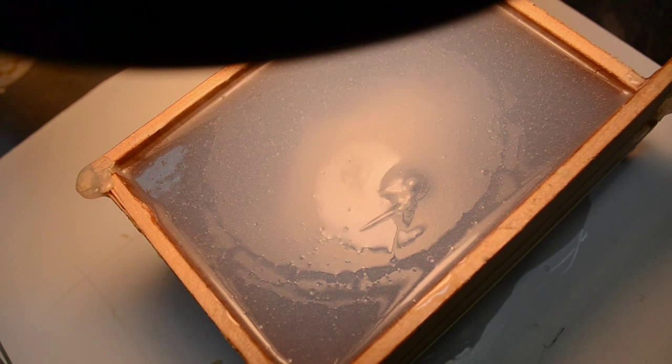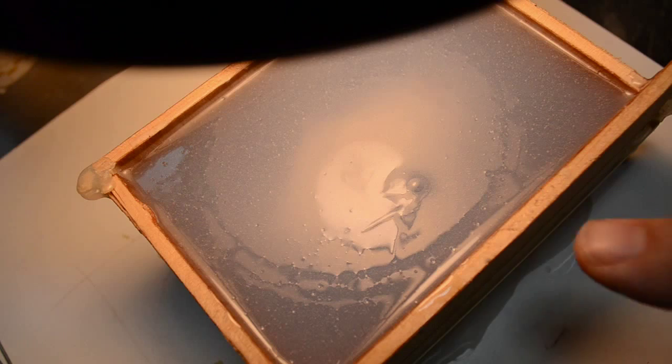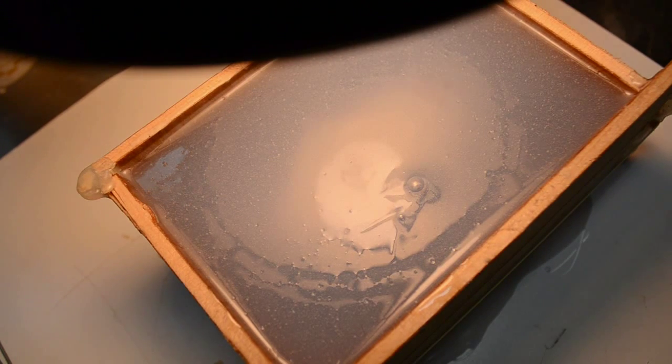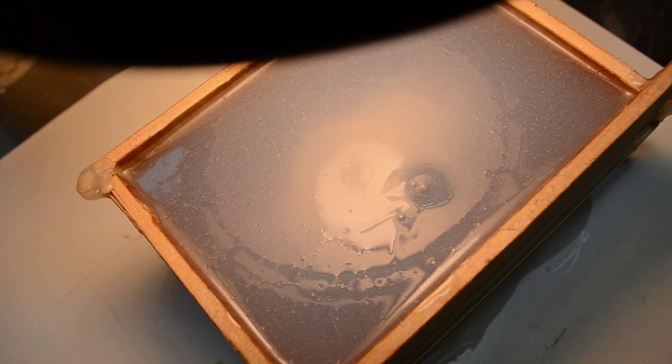The surface is going to have a little rise and I won't be able to put a flat top on it. The flat top I'm going to use will be one of these pieces of plywood — I'll cut a strip to the size of the top of this mold, actually just a little larger with slight overhangs, so when it's joined to the bottom piece of the mold for the underside of the skull and held with rubber bands, it will not crush down onto the silicone and deform it. This is really thickened up. All I can do is walk away and let it do its thing. Fingers crossed.